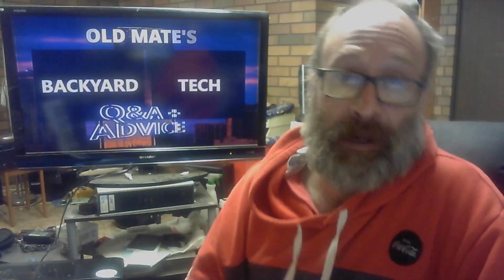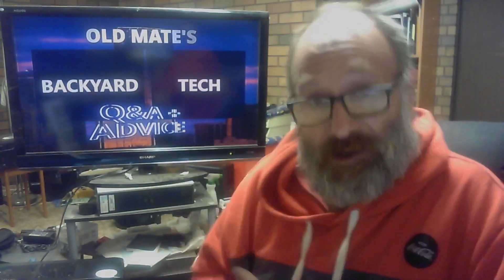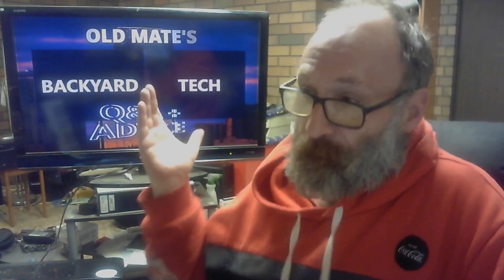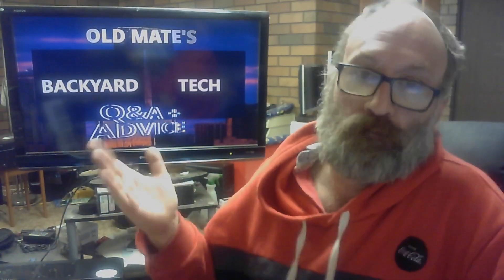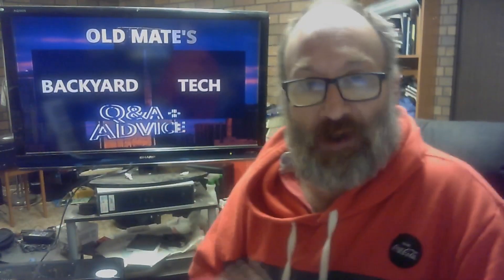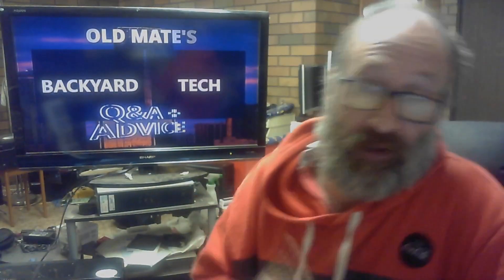Up at the other half's parents' church, unfortunately I've taken over, and I have unshielded power wire — brown and blue — for front of house going at 45 degrees to a bunch of fluoro lights. Absolutely immediate interference induction. Every time we turn the fluoro lights on, you can hear it go straight through the speakers. And we've got earth problems there anyway — there are two earth straps.